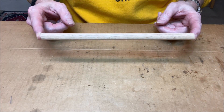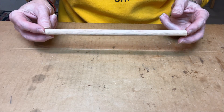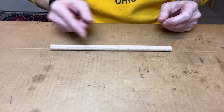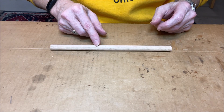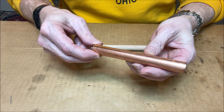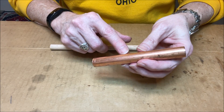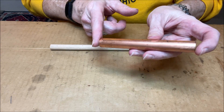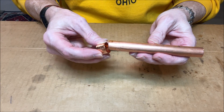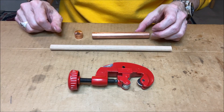The first thing I'm going to need is a length of half-inch wooden dowel rod — this is a scrap piece left over from some other long-ago project, made of oak, but any wood species will do. Next thing I'm going to need is a length of half-inch copper tubing. I cut this from a scrap piece I had left over; it's five inches long. And I've got a half-inch copper end cap that I'm going to solder on in just a few minutes.